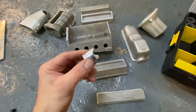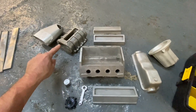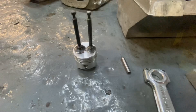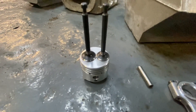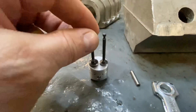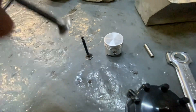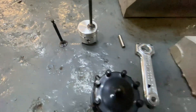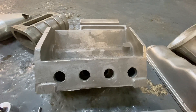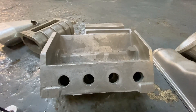This was made about ten years ago; some bits have been bought already — these are the pistons that have been made and these are the little conrods. There's also a supercharger but no rotors. You have to make a lot of parts: rockers, valves. This is an inlet and exhaust — that's a 12mm inlet valve and an 11mm exhaust. It needs quite a lot of work, and also I'm thinking 100cc — is it going to have enough torque low down to pull the Cobra? Because the Cobra is quite big.